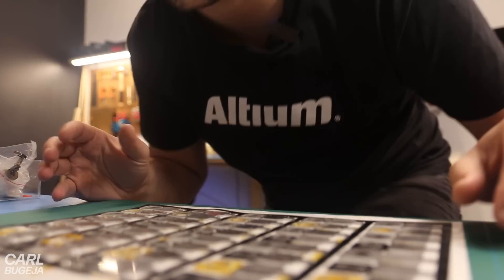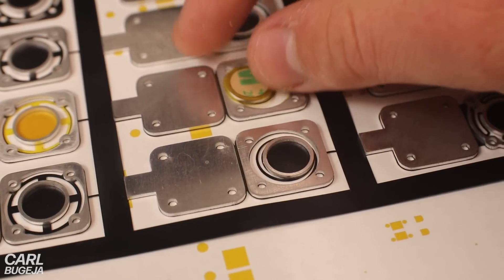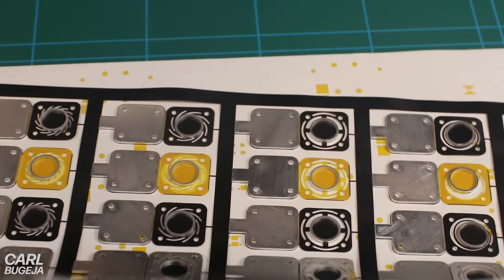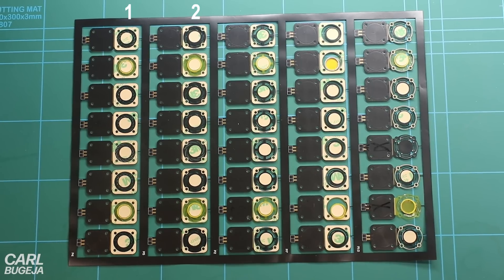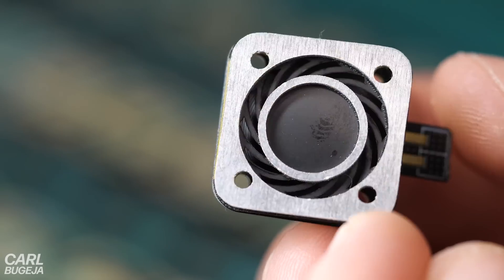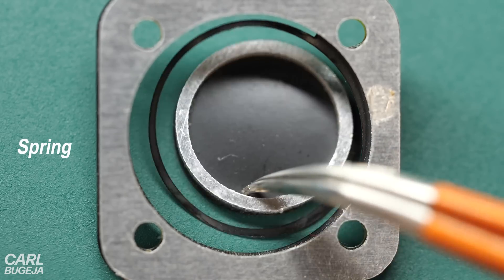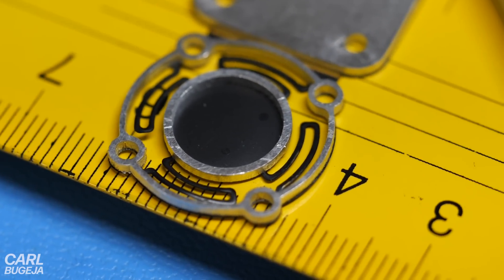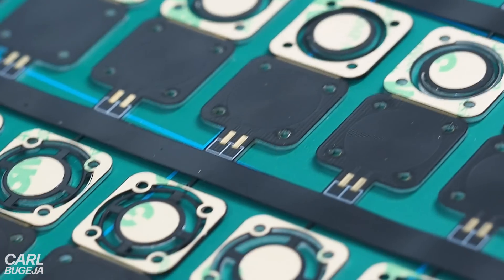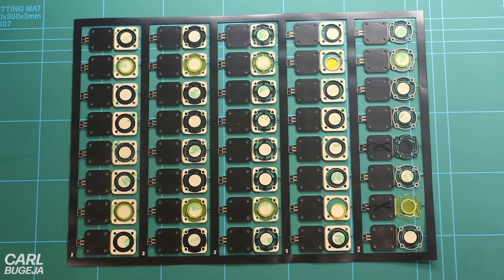We have to be super careful with these, as some of them look very fragile. Each column represents a different flexure geometry: we have a 14-arm spiral, an 8-arm, the circular design, a spring version, and a 4-arm zigzag spring. The width of their arms is at the absolute minimum, so the only other parameter left to tweak was the thickness — which is why there are 8 rows.